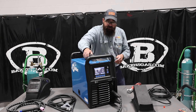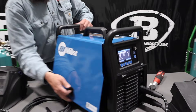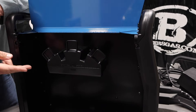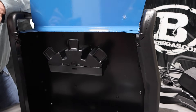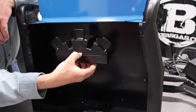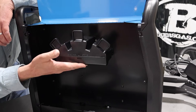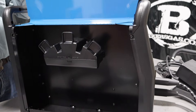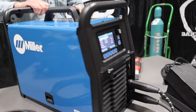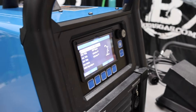New to this unit — pretty awesome. Inside, it's got a door just like your 220s. Notice there's no wire feeder — TIG and stick only machine, but we can put a spool gun on this. You can wrap up your leads and your TIG torch, and it's got a little consumable storage pouch right there. Put all your stuff in and click shut. You've got a lot of storage in there. Just like the old 210, you can hook on the Spoolmate 150 and run aluminum wire.